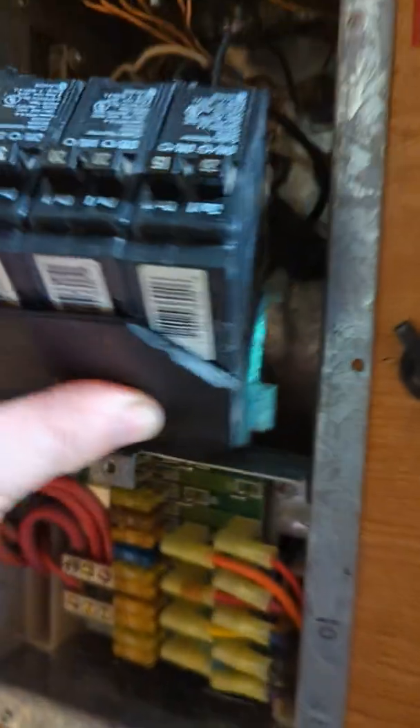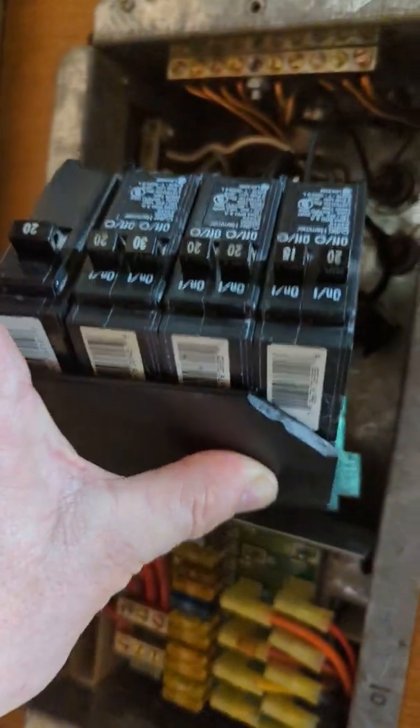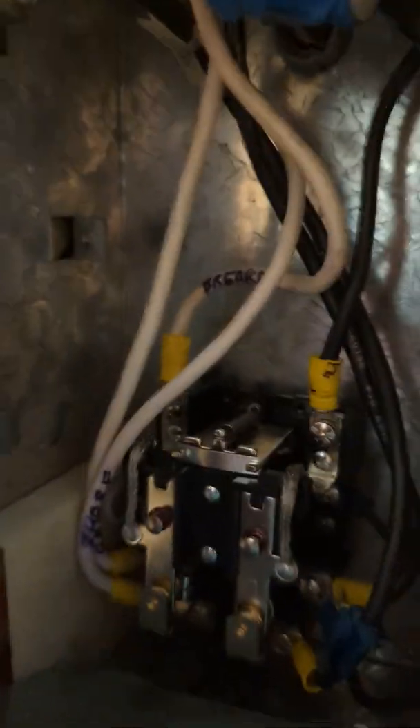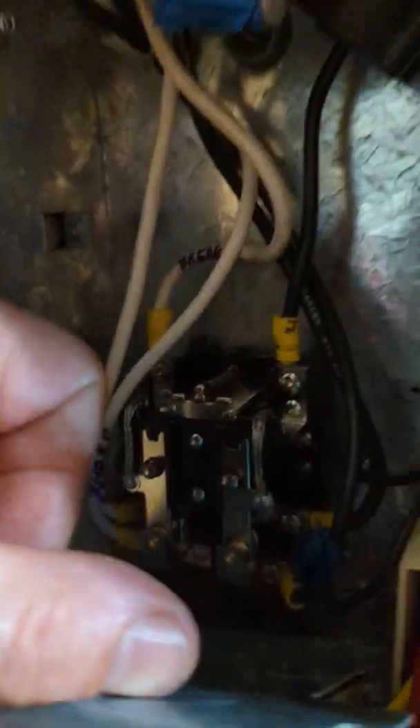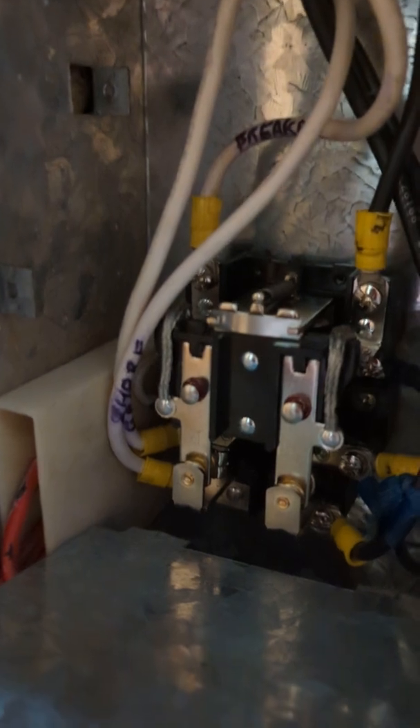This is your fuse panel, this is your 120-volt circuit breaker box — nothing's on, everything is off. That panel comes out with a screw, and then behind your 12-volt panel here — who would have ever found that? I started with where I had power and where I didn't, and just chased it until I found the load transfer switch.